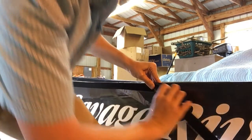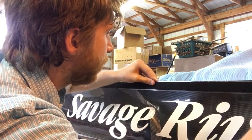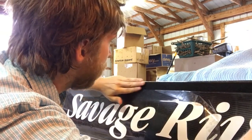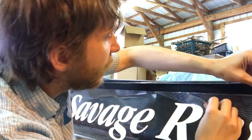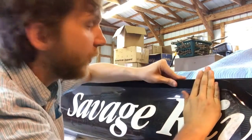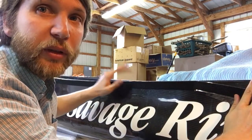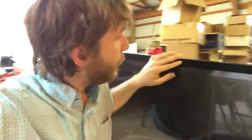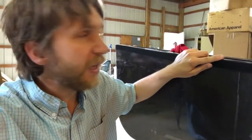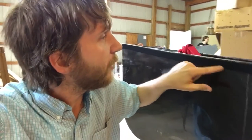I made sure the edge of the boat was really clean before we started, so the adhesive sticks to the boat and not to any dirt. We've put the Velcro all the way around the boat, from bow to stern. One piece started at the stern, went to the bow, and then went back to the stern. We've gone with one inch this time — I've used two inches in the past but that always seemed like overkill, so we cut down to one inch.